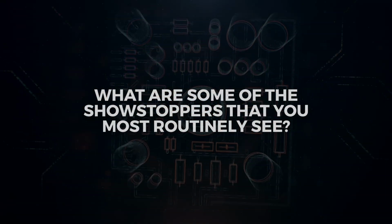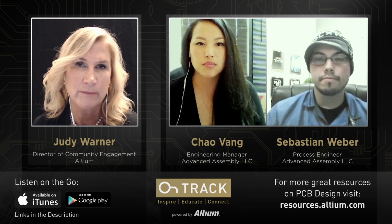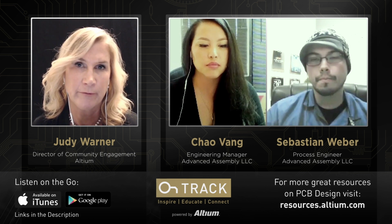Via in pad, especially on BGAs, those are usually issues. If we see micro-BGAs, like glass-topped micro-BGAs, we'll start looking at what steps need to be taken on production just to make sure we can mitigate any issues on the floor. Overage issues, if we know that there's really, really small parts like 0201s, 01005s, we'll make sure that we're getting the right amount of overage just to make sure that we're not shooting ourselves in the foot later on during assembly. Yeah. So what about via in pads, what in assembly comes up for you in that area?